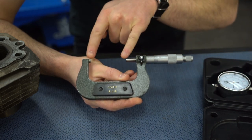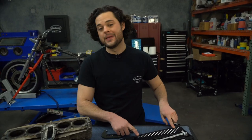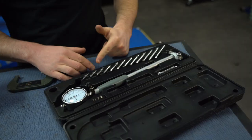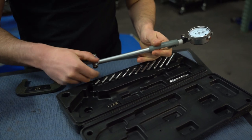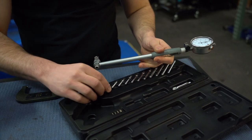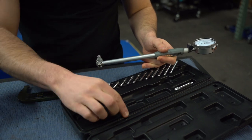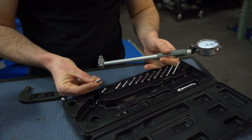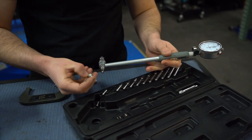Let's go ahead and get our bore gauge in here and get it zeroed out. What you want to do is go through the combination of pins and shims and come up with the right one that's going to fit in that micrometer so you can zero it out. I already know exactly which ones we need. In order to change the pins, I'm going to remove this piece here. You can see it comes with a pin already in there, and what we're going to need is this pin right here and this shim. I'm just going to put it on there like that, flip it in, and then reinstall.